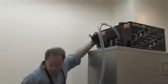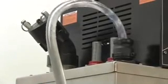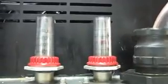put my methanol in the barrel, and I'm going to chug away with a pump. We're going to get methanol into our machine here. What you see now is a gauge that's coming up. You're able to see that we can fill this full of methanol. This tank is going to be used for what's called an esterification process, which is where we use sulfuric acid. We'll talk a little bit more about that in a minute, but for now, it's time to get the methanol on the machine.